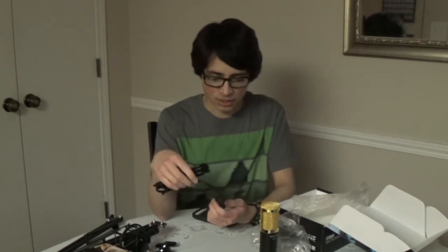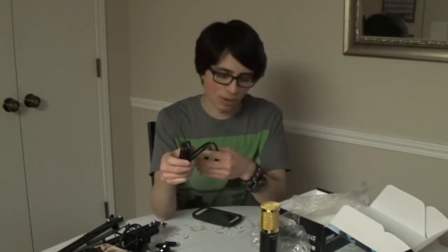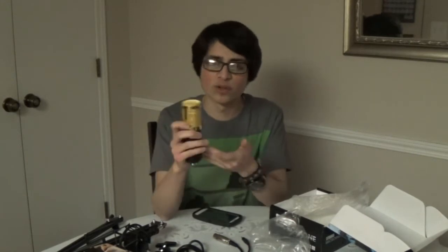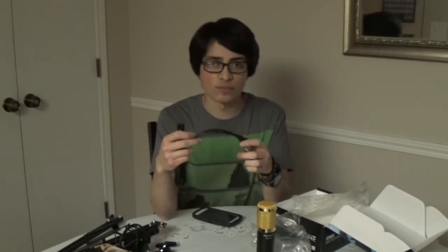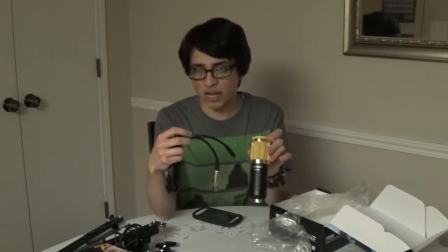I'm not going to be using the included cable because my computer doesn't have a 3.5mm audio input, only a headphone output. And even if it did, it probably wouldn't have enough voltage to power the microphone. So I'm going to plug this directly into my interface because it has phantom power — this microphone only requires about 5 volts and my interface outputs a full 48. There are computers that do output 5 or more volts, but not all of them do, so make sure your computer can power it. PodCastage also tested this with various USB sound cards and some work, some don't — watch his videos.